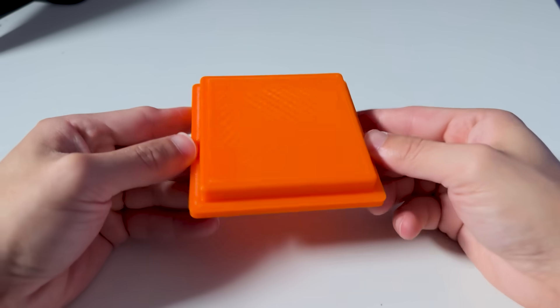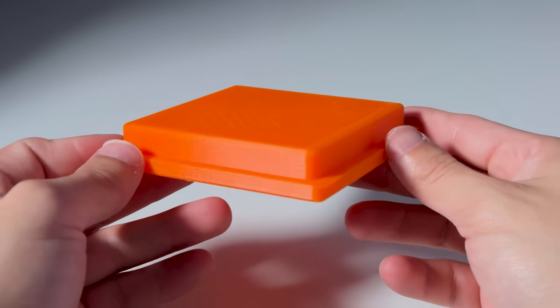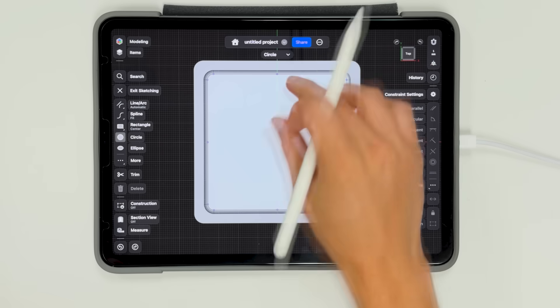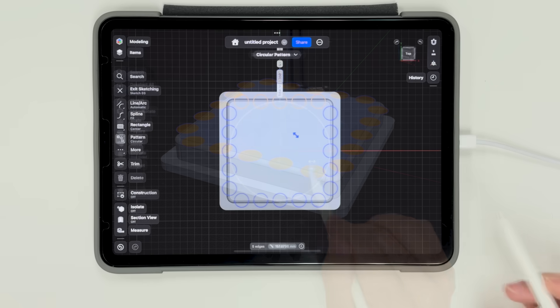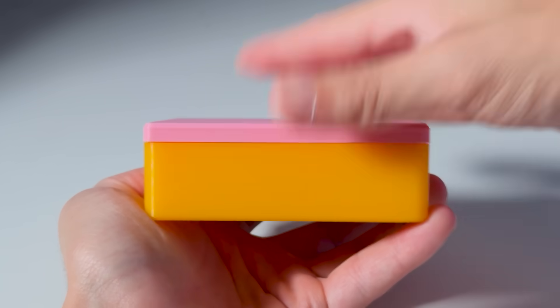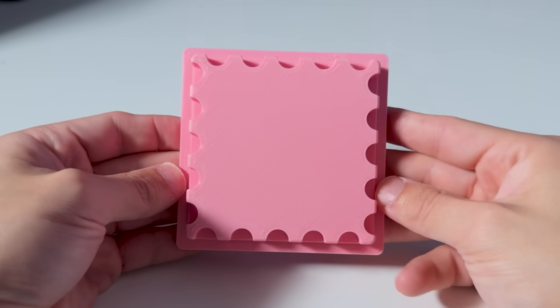This approach has the problem of having a lot of surface contact on the outer walls. So if there's any deviation, you have a lot of surface area to work against when trying to insert something together. One way of getting around this is to just remove the amount of surface contact on the outer edge of the part. This can be done simply by going around the outer side and cutting out some holes, so it can go together much more easily because you don't have as much interference and you don't have the layer lines interlocking either.